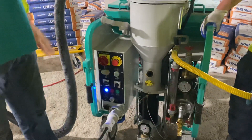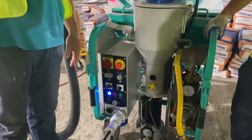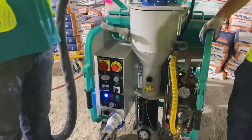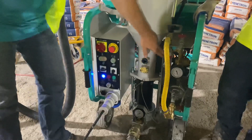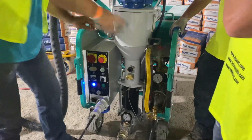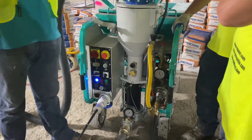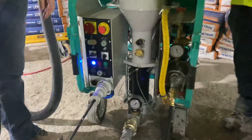When you have your water set at 1200 and you're pumping and the consistency is exactly what you want, there is no reason in the world to touch the water — you're good. I've seen people panic and crank it for no reason. At 1200, if the consistency is what you want, leave it alone.